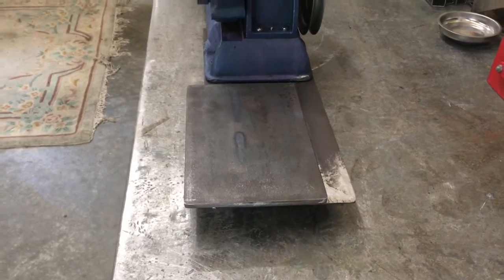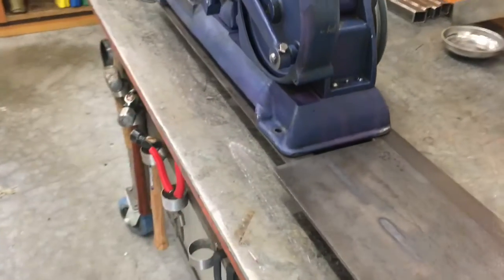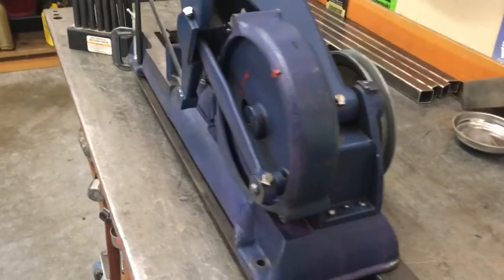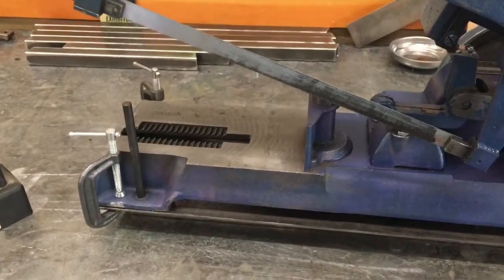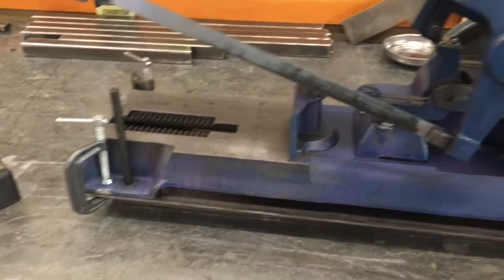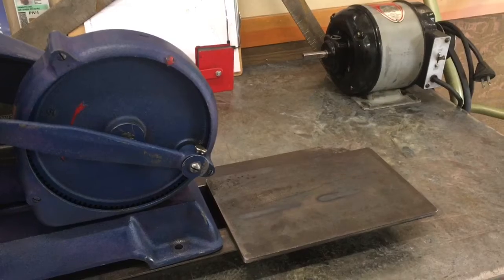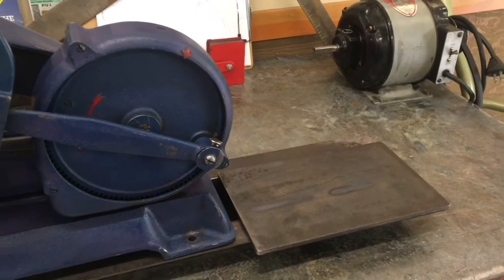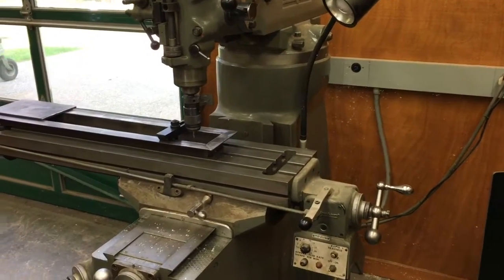Okay, I got that plate stuck down. I'm sure it's not going anywhere. And then I just set this on where it's going to go, and then I'll take a transfer punch and transfer the mounting holes for this, and then figure out the motor mounting holes, and then that's when we'll go back and drill them once I get this all figured out here. So getting close.